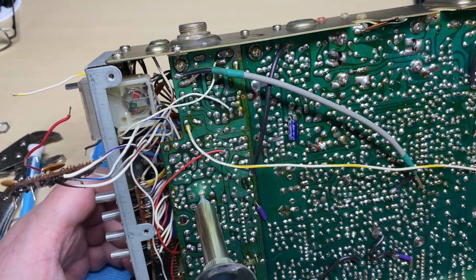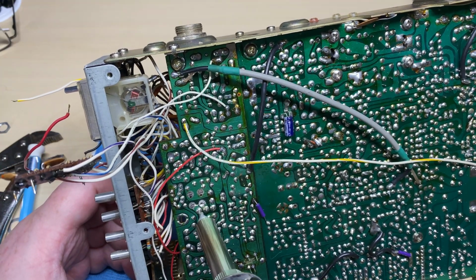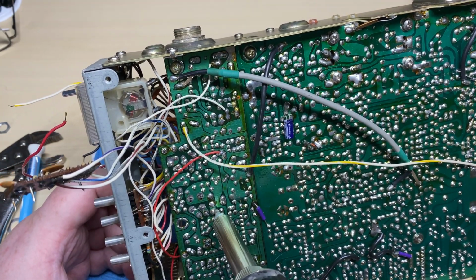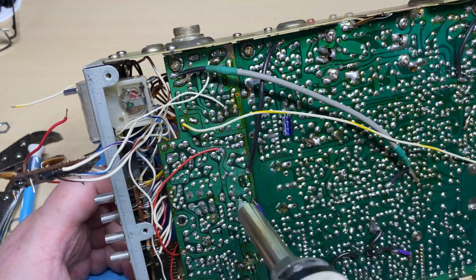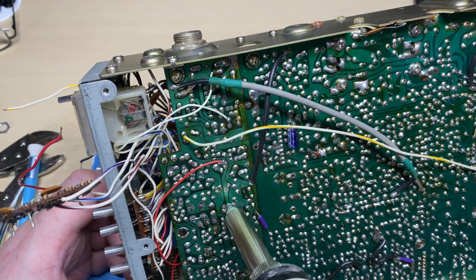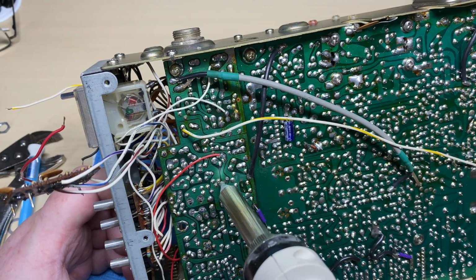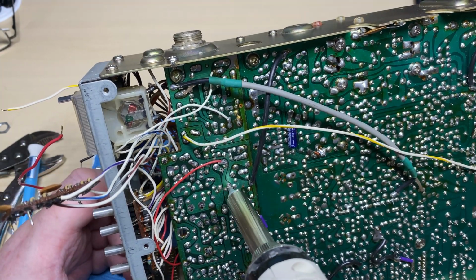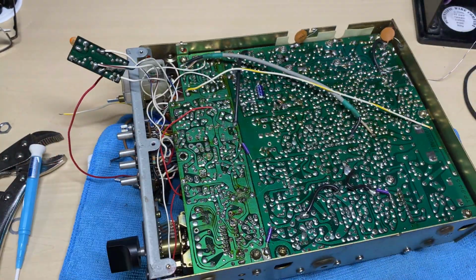And we're just going to blatantly tear out a load of parts. So how these multimodes work is there's a 3-position band switch. One of the wafers actually physically switches the crystals. The other wafer switches the crystal trimmers. There's a wafer to switch VCO voltage. And then there's a wafer for the high light.